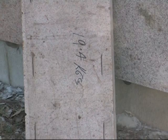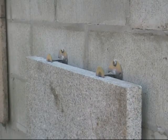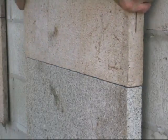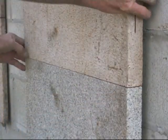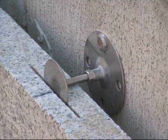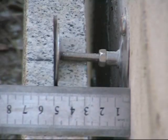The benefit of the two circles connected by the threaded rod allow the adjustable clip to be moved in or out to where plumb is on the panel, and to move the clip fixing point to top dead center when installing the final fixing. The clip is positioned back to front while adjusting plumb on the panel, then excess thread, if any, is cut off with a grinder. The clip is then repositioned correctly prior to the final fixing into the substrate.